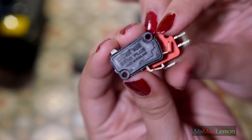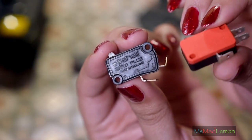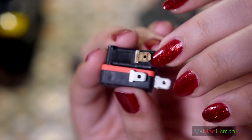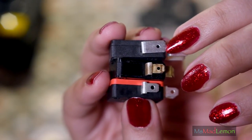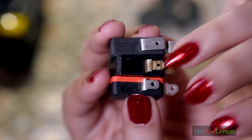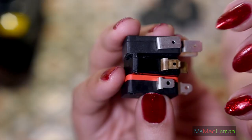However, there is a big difference. Look at the shape of the spade connectors on this one versus this one — you can see there's a huge difference. The plugs for the spade connectors are compatible with these two, but not with that one. The joystick I replaced last time used these microswitches, and I realized afterwards that the spade connectors were different, so I had to just solder them on directly. It works but it's not ideal.